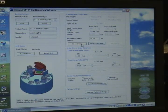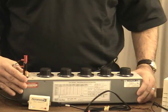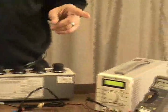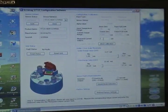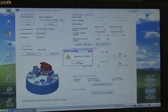Go to step three, and now this step will set the linearization for the module. I'm going to leave my input at the full scale 119.4 ohms. I'm going to read my meter, which is reading 20.01 milliamps. I type that in and calibration is complete.